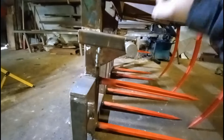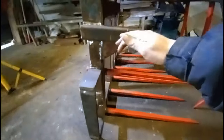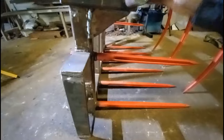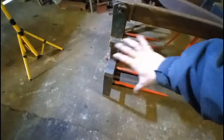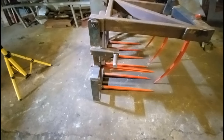And on the bucket, it's very similar. You have a bar sticking out like this on the bucket, and you have a bar sticking out there on the bucket. And the distance between this bar and that bar is 6 inches. So if you came out 6 inches here and up, that's 6 inches right there. So anyways, I'm going to show you the clip now of us testing this mechanism that we've made, of it tipping in and tipping out.